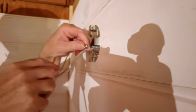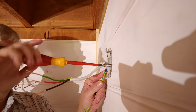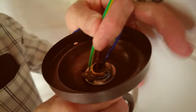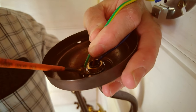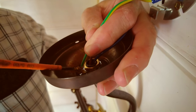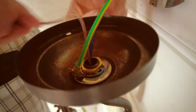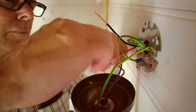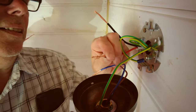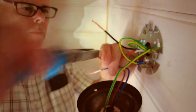A little crimped tab onto an earth cable to begin earthing the components. There's also an earth tab inside the wall plate and we will need to connect to that as well. It's a bit dark in here but we're just connecting the earth to the inside terminal that we provide to earth the main body of this light fitting. We could have an earth coming out of the tube from the light but in this case we just put an earth tab on the mount plate. Now we just connect active and neutral — active to active and neutral to neutral, to state the obvious. Just give ourselves a bit of wire to work with and turn it over for the big connector.